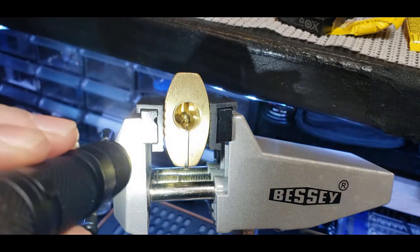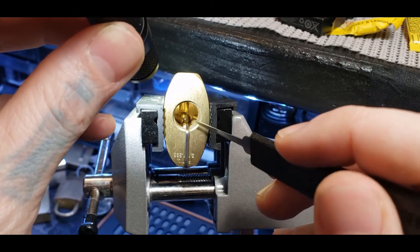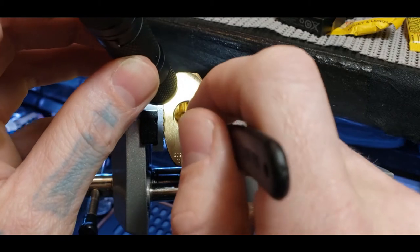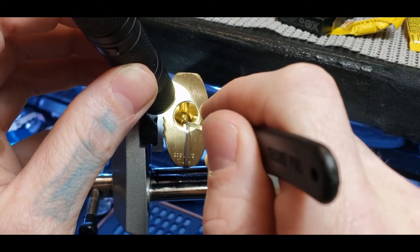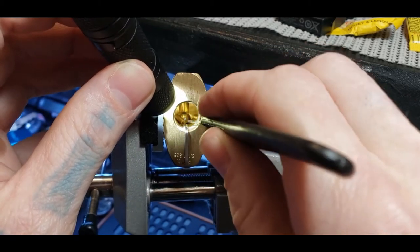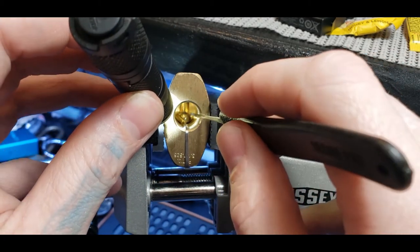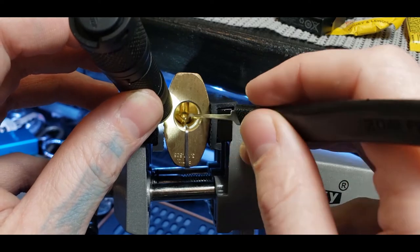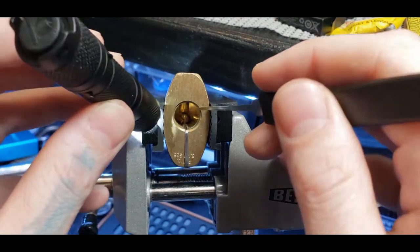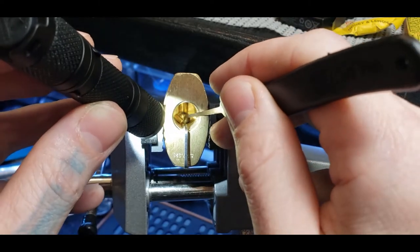See how in the very back those pins came out and see how the tool is a little off to the right. You can see the pins sticking up there coming out of their holes — the tool is barely on the nose. I'm going to push that back over and push it all down as well. That's the part that sucks because to pin these now, you have to take your tweezers, hold these down and with the tool move this over to one side a little bit to get that driver pin in there and then put this thin tool back on top of it. This tool does not have a lot of tension holding these down.